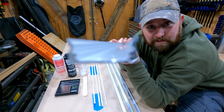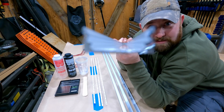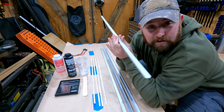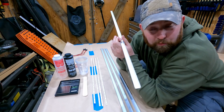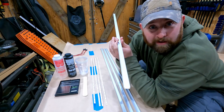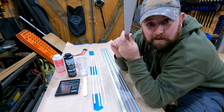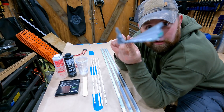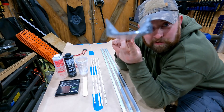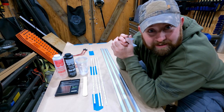You can see the little C-shape of the channel — the LED strip sits down in there. Normally there's a cap that covers the top to help diffuse it. If you're going to use this indoors you don't need to use resin; you can just use the provided diffuser caps, which look really nice and finished — that's what I'm using in my camper for the interior. But to make it super waterproof, I'm going to lay the LEDs in there and fill the channel with resin.